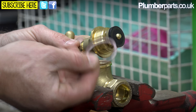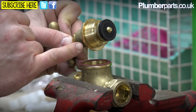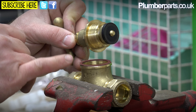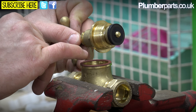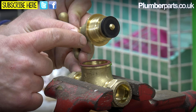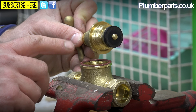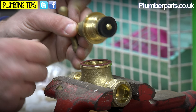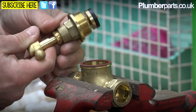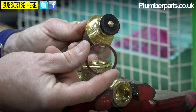First thing, we've got our fiber washer here. What this does is it sits on this collar here and creates a watertight seal when you tighten this thread up. That's the first place that some of these can actually leak. You'll find the fiber washer has even fallen apart and you might need a replacement. Often people will wrap a load of PTFE around here and pop that back in, but the problem is it doesn't quite lock the fitting like a fiber washer would. If it's being worked inside and out, this bit can actually come untwisted and come out of the valve, creating even more of a problem.